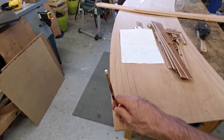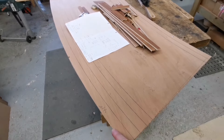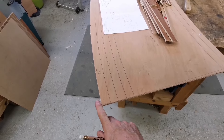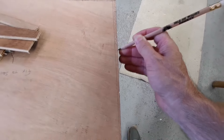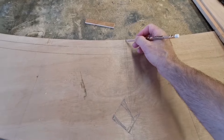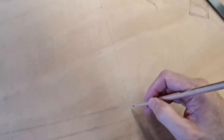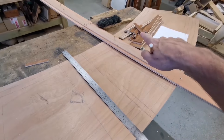I've agreed with Lloyd that the outside of the seat will touch the wall and the backrest will come in and up, almost but not quite touching the wall, to protect the backrest from being knocked around. If the backrest touched the wall directly there's a danger of it breaking. Lloyd also wants the seats to almost be fixed in place, so having the seat connection to the wall is better anyway. I've now got marks at 1014 and 1200, and I'm taking the middle line between them.